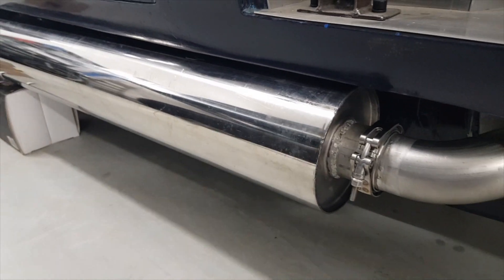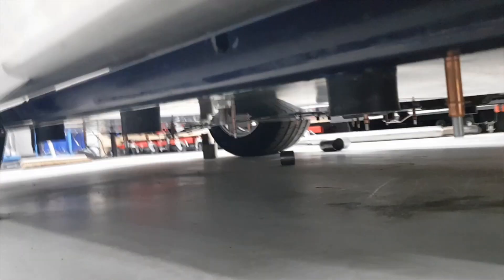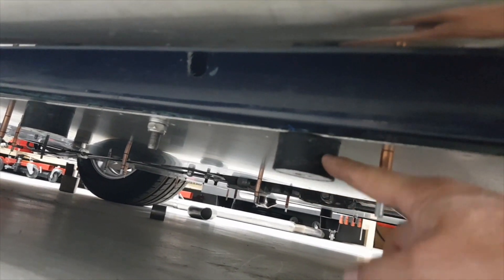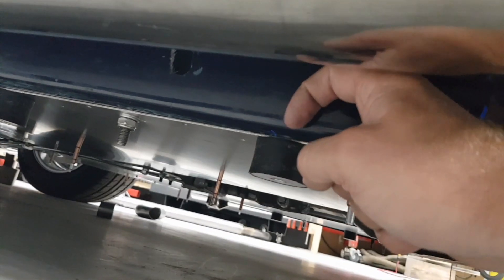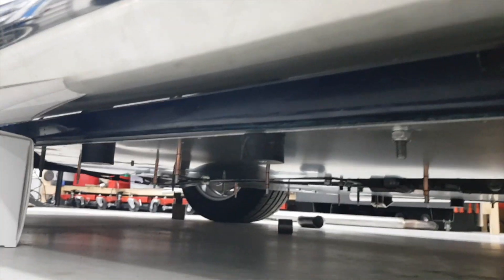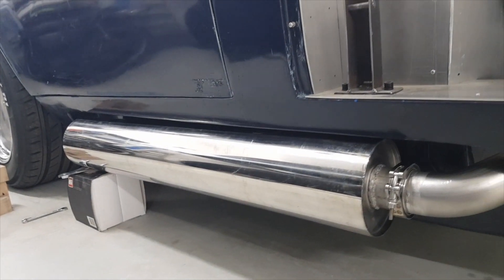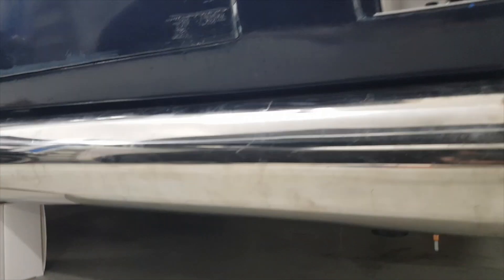Instead, I went with a concept using the chassis frame rail which runs all the way down the side. I've through-bolted through the chassis with these 50 by 30 rubber cotton reel anti-vibration mounts, female both sides, bolted through the 50mm box section frame rail. There are three of them, approximately 12 inches — 300mm — apart on a 36-inch tube: one six inches from each end and one in the middle.